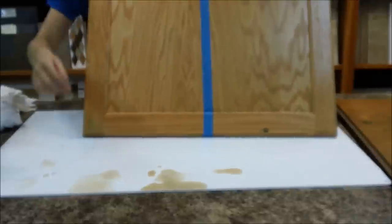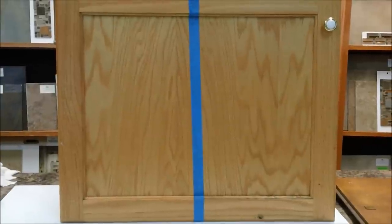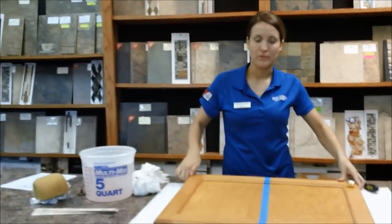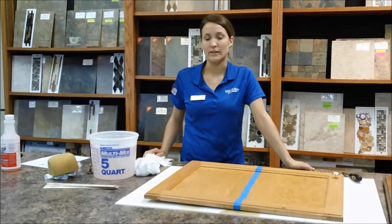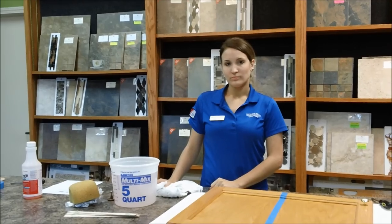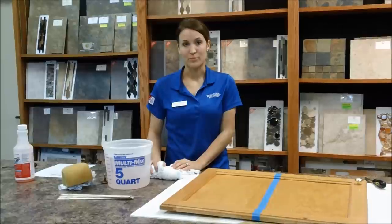As you can see, we've still got a lot of residue draining off, and you can see all of that dirt and grime that was in the grooves is now gone compared to the other side that is still pretty dirty. I want to reiterate that you do want to wear some kind of protection. When spraying TSP onto a deck, fence, or siding, wear eye protection because the spray can come back into your eyes and it will burn. You can use a garden sprayer or add it to your pressure washer, and it can also help treat mold if you add some bleach to the formula. If you have any questions, stop by Dugan's and we'll talk you through any project. Come by and see us.